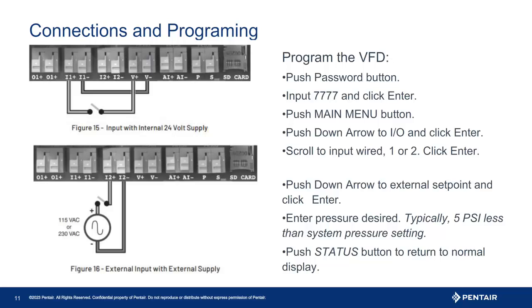Open a valve to start the drawdown of pressure slowly — we want to go slow and change the position of the float. For a run command, the unit will not fault, but in the down position the points open, the drive will stop and read zero amps. Lifting the float, the points will close and the drive will energize the pump and run. With the external fault setting, the drive should fault when the points of the float switch close. Repeat this several times to ensure the float triggers as needed.